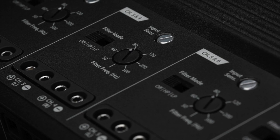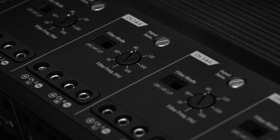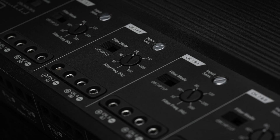The other system that I really like is using two of the channels for your front speakers, two of the channels for the rear speakers, and taking the remaining two sets of channels and bridging them to subwoofers. So it becomes a full system amplifier in one chassis.